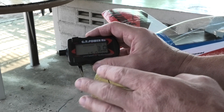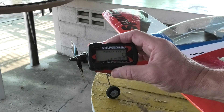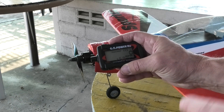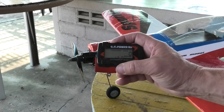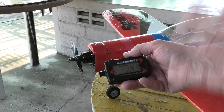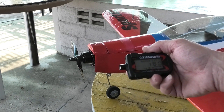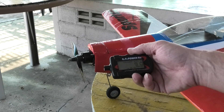I've compared it with a friend who has an identical one and we got very similar results, which was encouraging. I also compared it with a friend's Thunder Tiger tachometer, which he's tested and is confident is accurate - and again, very similar results. When I compared it to the frequency you get from the flashing of fluorescent tubes, it was reading the correct frequency. I think that's one of the problems people have been having - doing reviews indoors under fluorescent light and just saying it's not working.